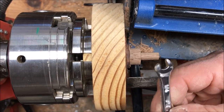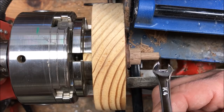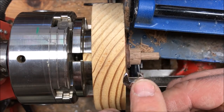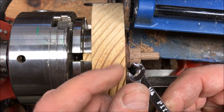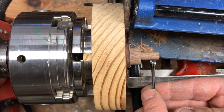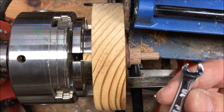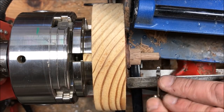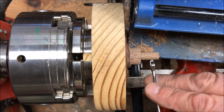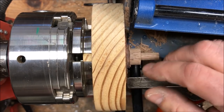As we start to get close to a quarter of an inch I'm going to pause. This is a quarter-inch wrench I picked up from Harbor Freight — a discount tool store here in the U.S. that sells inexpensive Chinese-made tools. I bought a set of these wrenches for just a couple of bucks. You'll notice this end of the wrench is turned off a little bit — I've got a video for how I do this, but I go to the grinder, grind this off so it makes a sharp edge. That lets me come in and put this underneath a piece of wood, and the cutter will cut that piece of wood to exactly a one-quarter inch diameter dowel. If I have to hog out too much material, it's going to make the tool work too hard and we stand the potential of catching and ripping this off of the sacrificial block.